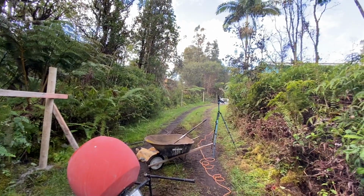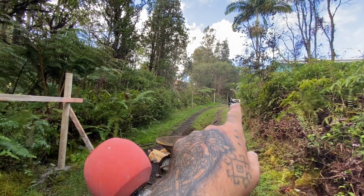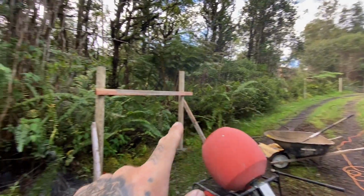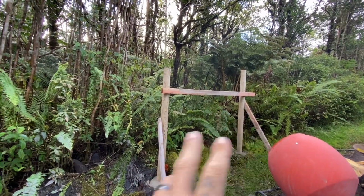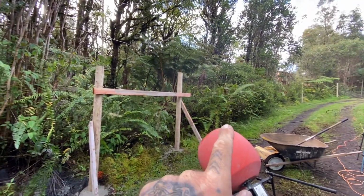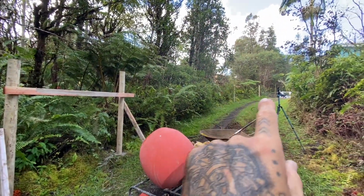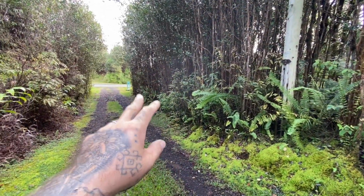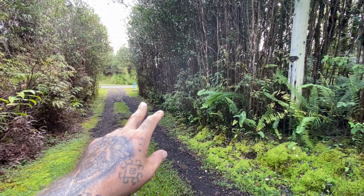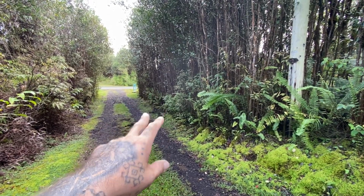So once I attach the fence all the way up there at the chicken coop, it will run around these posts down here, and then this is where I'll stretch it to pull it tight, then attach it, and then there will be T-posts every 10 feet to fill in the space. And then once it's attached here, I can do the same thing, because there will be 2 posts there once the gate post is put in. I can stretch it down to that point and then attach it, and then this section will be done.